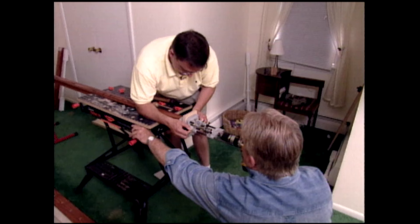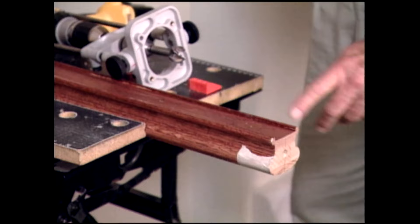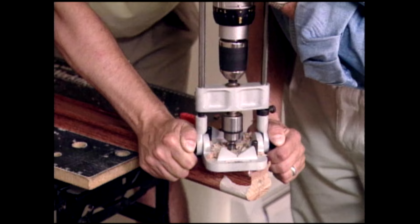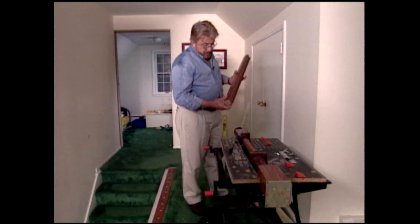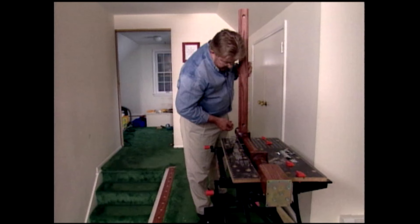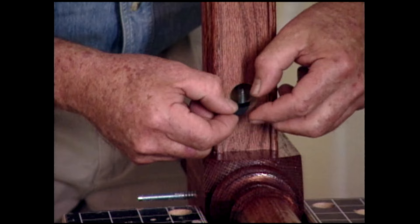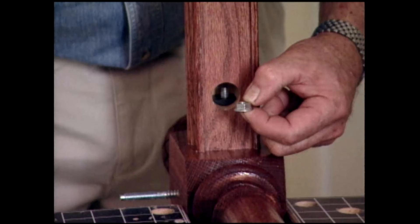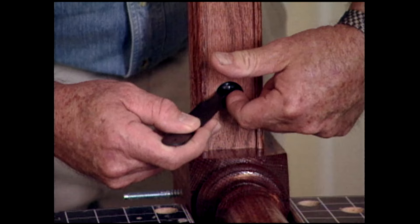Next, we secure the railing on the workbench and bore a hole into the end. I've added a piece of wood to the drill press base to make it more stable. Then, using a larger one-inch bit, I drill a second hole into the bottom of the handrail that will intersect the first. Now it's time to connect the railings to the newel post. This is the hanger bolt we put in earlier — we slip the hole in the rail end over the hanger bolt. Inside the larger hole, I slip in a washer with a convex surface that forms to the edge of the hole, giving a flat surface on which to install the combination nut washer, tightened with the special wrench that comes with the kit.